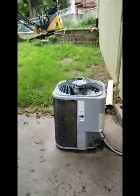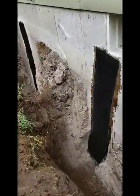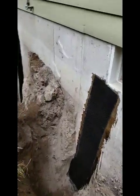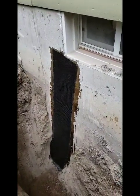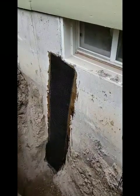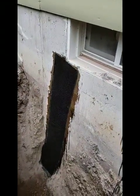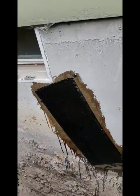Go outside and show you what we did for repairs on the outside — we excavated down this side of the foundation to expose those cracks. Then you can see here we put a 12-inch wide bi-directional carbon fiber strap on both of those cracks to seal them up on the outside before we did the injection inside. That gets a bond on the foundation wall back together on both sides of that crack, and it's also going to help to keep that polyurethane injection inside the crack, otherwise we'd just be pumping it right out into our hole out here.